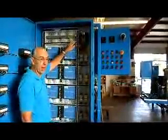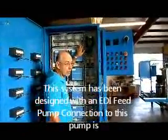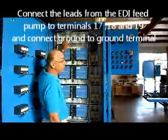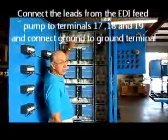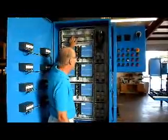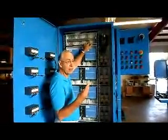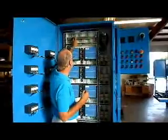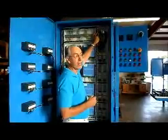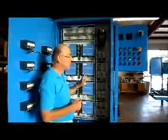You will also connect the power connections to your EDI feed pump, which will again be with 3-phase, 380 volts, 50 hertz power. You're going to connect the 3 leads to terminals 17, 18, and 19 in the bottom right here. Connect those to your pump — 3 leads to that, and your 4th wire to ground. You're bringing 4 wires: 3 legs of your 3-phase power plus 1 ground — terminals 17, 18, 19 for the pump and the ground. This is 80 amps, so those are the only two connections you need to make.